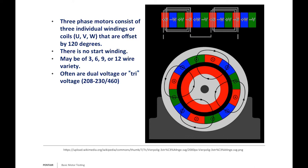Three-phase motors have three windings—T1, T2, T3—with coils called U, V, and W offset by 120 degrees. They don't need a start winding and have no built-in overload. When dealing with a three-phase motor—whether above ground, submersible, or centrifugal—you must add external overload protection. The degree of protection depends on the job site and ambient temperature, which is why it's sold separately. If you don't put protection on them, you're running a risk every time.